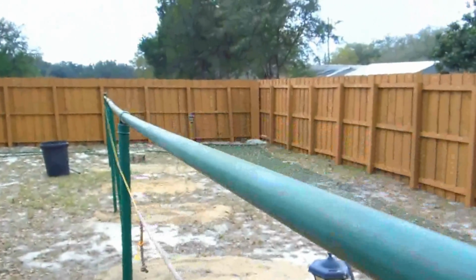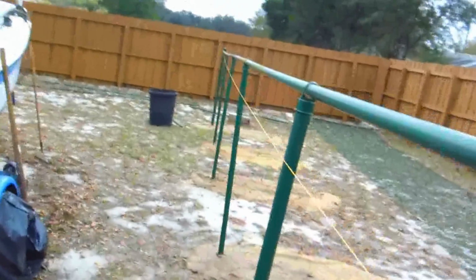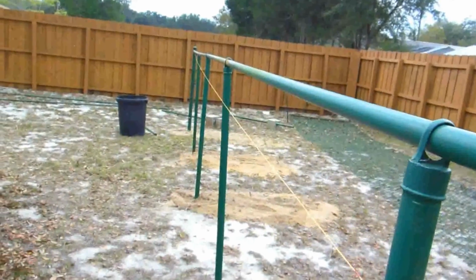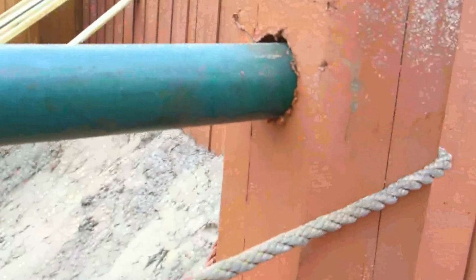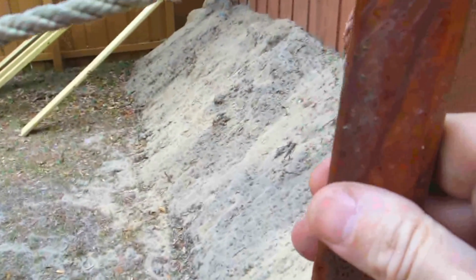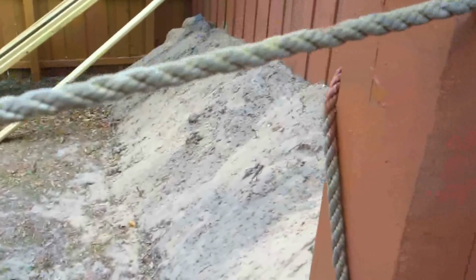Okay, I got the fence down here. It's pretty straight, except just one pole's a little crooked, but no big deal. And it's straight across the top, and they're all in there, cement, all that stuff. And this side I drilled a little hole, because this is going to be a wood gate, and on the end of the fence I'm going to use this pressure treated stuff I stained up and cut to 5 feet, weave it through the fence, and then nail it to the other side.